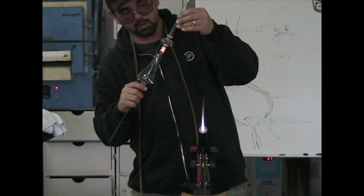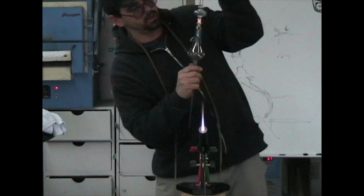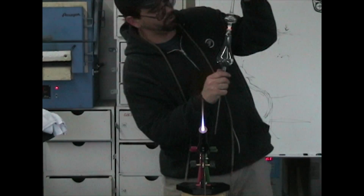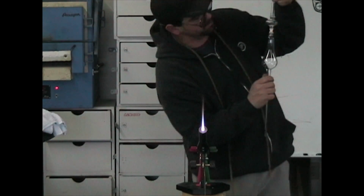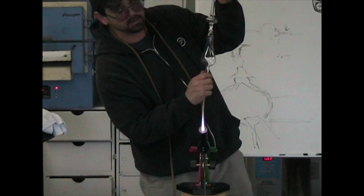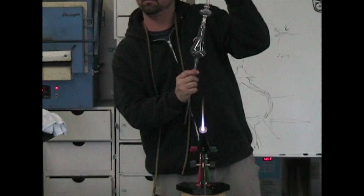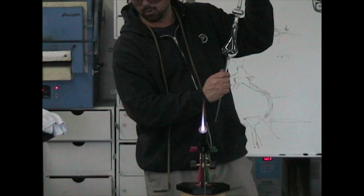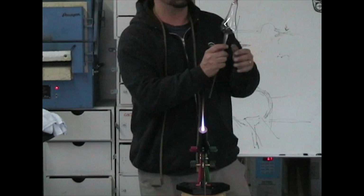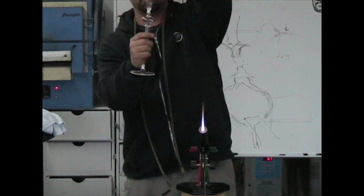If you do it too much though, you'll put some scuzz on your glass and make it devitrify or just kind of show a funky scuzzy spot. Like that kind of white scuzz. That's not really quite devit, but it's like a little bit of foamy bubble stuff on it because you messed the surface up with the metal. You guys know what I'm talking about? That look. So when you go back and define it, don't overdo it.